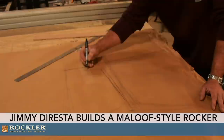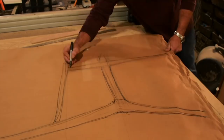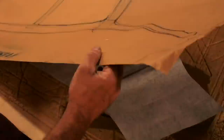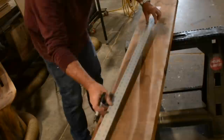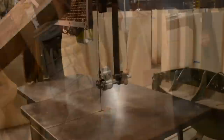What you're seeing here is me laying out my concept for a Maloof-inspired rocking chair. It's fairly complex in its simplicity — the structure, design, and flow of materials. To better understand it, I started to draw it and work out some basics: height, width, length. I based it on a craftsman-style chair I had in my shop, using typical measurements — seats are typically 17 inches high. I'm transferring those rough shapes onto a piece of 2-inch walnut and refining them.